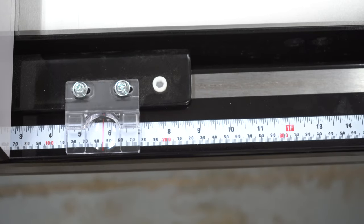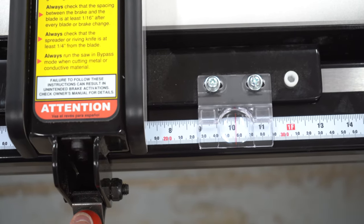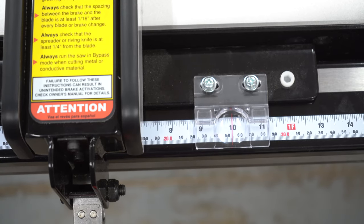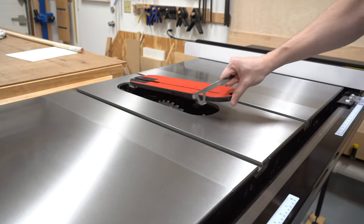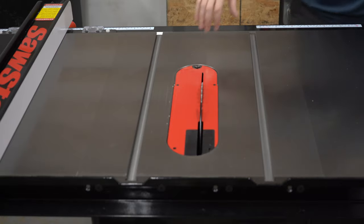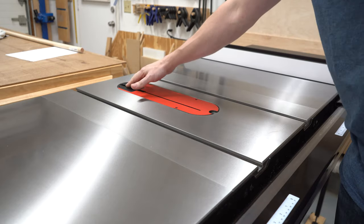Five are just some quality of life enhancements. There are a lot of small features that may not be proprietary to SawStop, but I had never experienced them before. Here's a quick rundown of some of those enhancements this saw gave me over the Delta. The magnified fence ruler — when I first saw this I thought it was a little gimmicky, but after a couple of uses I instantly realized how nice it was. I have really good eyesight since I had LASIK a few years back and even I found it helpful to not have to hunch over it. Next is throat plate removal — the way this plate locks into the front and the back is great as it eliminates the chance of it moving or popping up when you're cutting thinner stock or applying downward pressure on the throat plate during a cut.